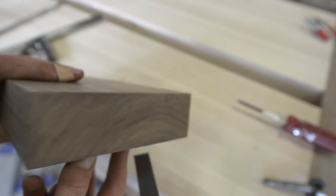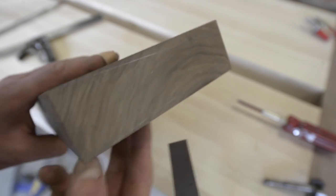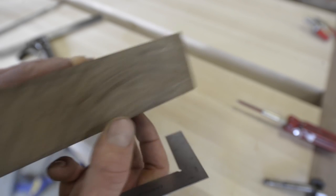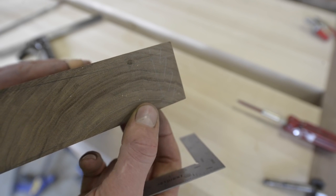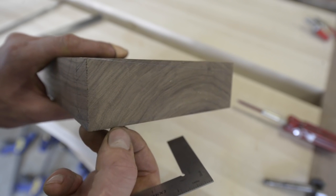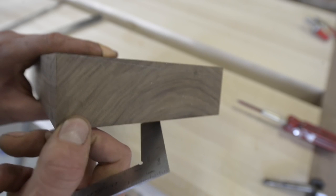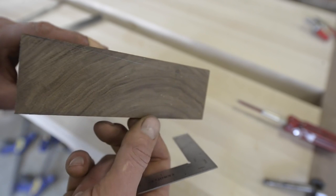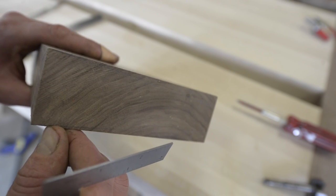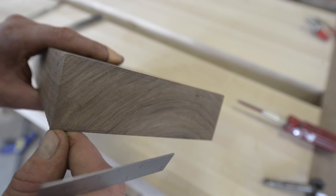So having it tapered like this, you can see the benefit is that as we start, the joint is this wide, the opening, the mortise, and as it starts in here, it'll be loose, right? And so the piece will just slide in freehand, no problem. And then right as we get to the end of the joint, that's when you start to get contact and create that friction. So we're gonna cut our joint just so that we get contact maybe about here. And then we just have to pound it that 1/2 inch to get a really tight fit.